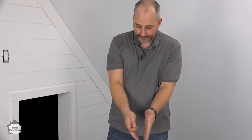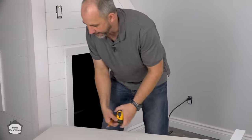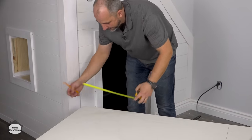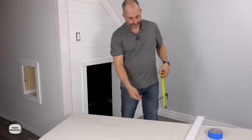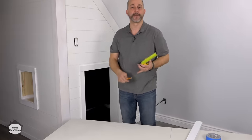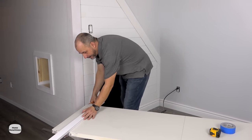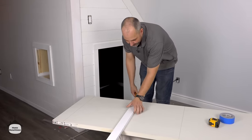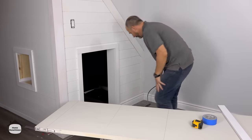Now in this situation it's almost half a door, so it's going to be awkward to work with. What I'm going to do is first take off about a four-inch piece here, because the important aspect of this door is it has a core installed in the bottom. If you just cut it down and stick it in the hole, you're going to have a huge open space for all kinds of critters to make homes, and it's going to be nasty long term. So we want to cut straight — it's easy on the blade — and then cut the door down to a more manageable size.